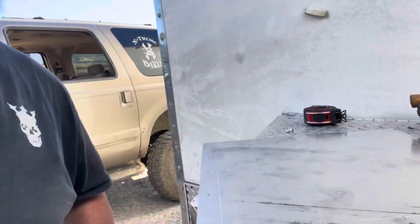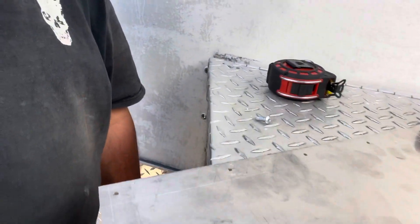What we're going to use to fasten this plate to the roof are 14 by three-quarter pan-type sheet metal screws. All the wood screws I have are just too long and I don't want to go through the roof to the interior. These are three-quarters of an inch. We've got three-quarter inch plywood up there plus the eighth of an inch for the plate, so that should keep us safe from puncturing through anything below the surface of the roof. So I've gone through and laid out where I'm going to drill all my holes, and we're going to sand all the edges before we take it up there.